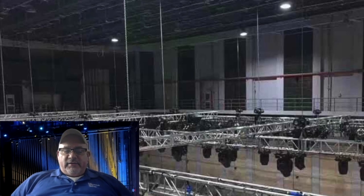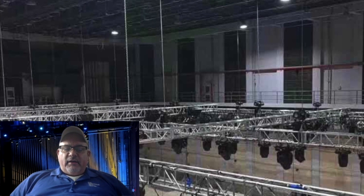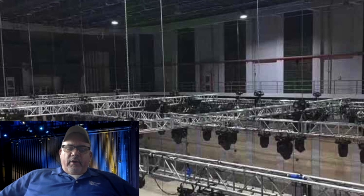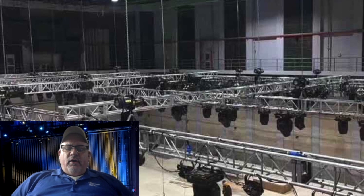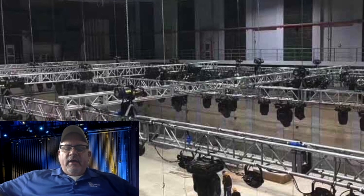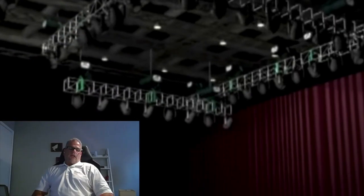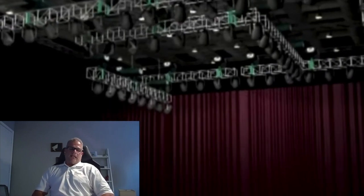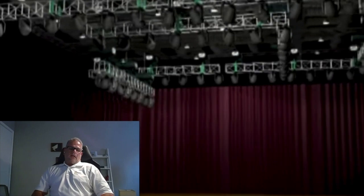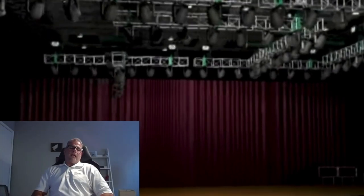Finally, let's chat with Tim Callahan, our head carpenter at the Windspear Opera House, about automated motors and how they're currently being used in shows. We've talked about counterweight systems and electronic automated line sets — now, why would someone want to use motors when you already have a counterweight system in the theater? When a show decides to use motors, number one it's a lot quicker — you don't have to send two people up to load an arbor and hang individual lamps. You can come in on the truss system with everything already in the truss, hang the motor, and snap in.